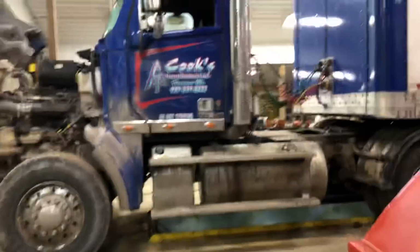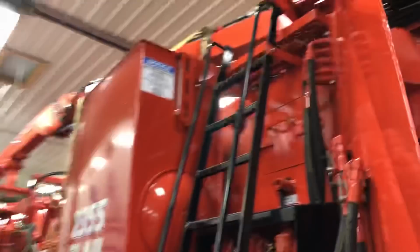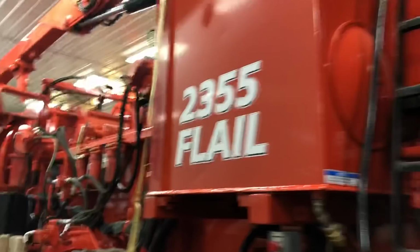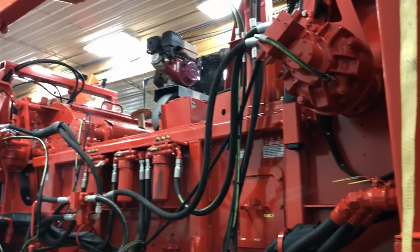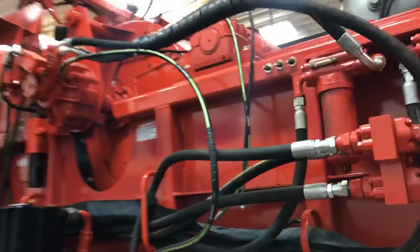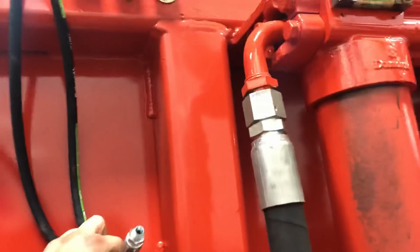And then there's a lot more greasing going on up in your boom. That stuff's gonna take time. And your bearing for your turret, all that stuff, just that is what it is. So you're still gonna have to do some greasing up there, like your cylinder here and your cylinder here. Your pins on that are gonna have to get greased, but at least you don't have to walk over here to the edges and grease that outer bearing, because we're gonna run it like a boss. So we'll run those two down. They'll pop out up here.